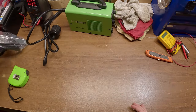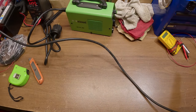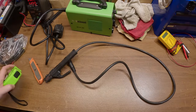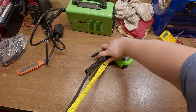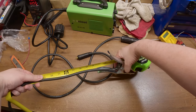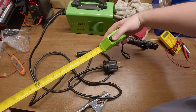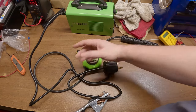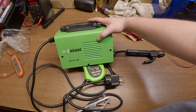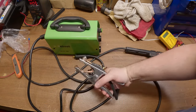Let's take a look at the electrode holder — pretty basic but no problems with that. One issue all these cheaper stick welders have is that the electrode cables aren't very long. The cable is just a little bit less than five feet, the ground clamp is about three and a half feet, and the power cable is about four and a half feet. It would be nice if they were longer, but I looked around on Amazon and couldn't find any of these inexpensive machines with longer than five or six foot leads.